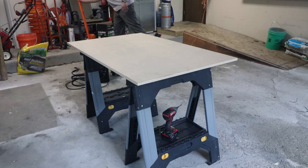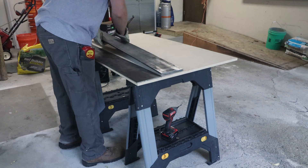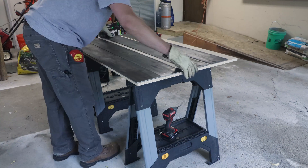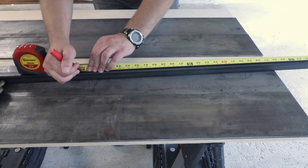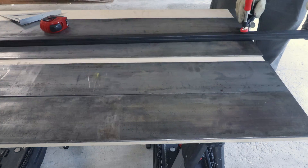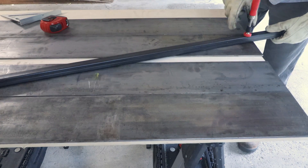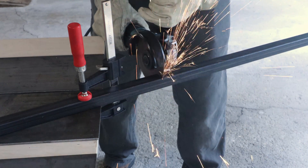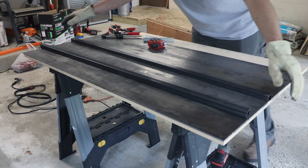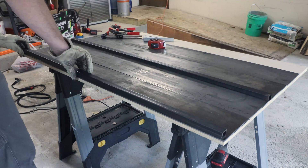I'm using a piece of very flat 3/4 inch Baltic Birch plywood to build off of, and checking that the plywood is level prior to beginning. This way, I maximize my chances of the welding table being flat when I'm done. To provide space for a clamp to fit through, I'm using one of the square tube pieces as a spacer in the middle of the table, and then clamping everything down to keep it from moving.